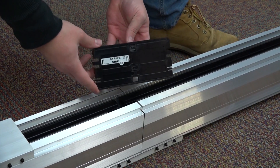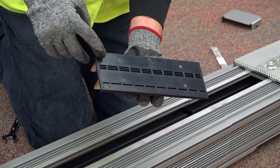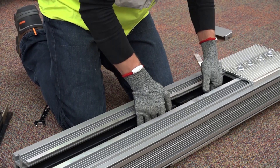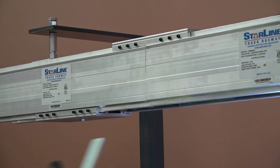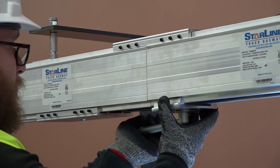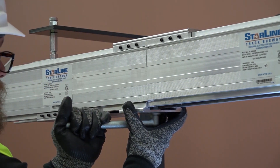Next, install the bus connector kit. Be sure to match the stripe side with the polarized stripe and the non-stripe side to the non-polarized side. To do this, insert the AB bus connector inside the slot of the busway. Ensure the connector is centered on the joint and push the bus connector in until it is seated. Then, insert the installation tool inside the slot of the busway at the joint. Position the collar around the busway housing. Using the lever, rotate the installation tool and release, working toward the end of the bus connector until the copper blades are firmly seated into the channels.